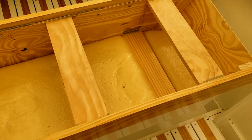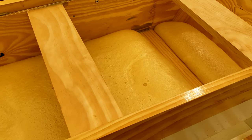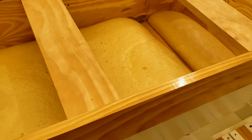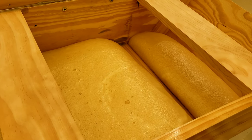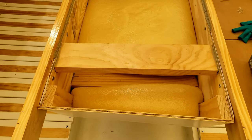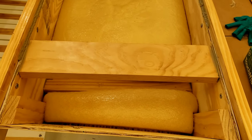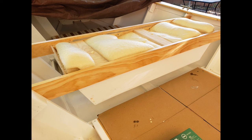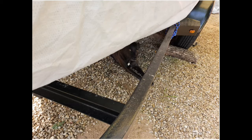Here's another sped-up view of the other seat. You have about 15 minutes until this stuff is fully cured — it doesn't take a lot of time. After 15 or 20 minutes, you can actually touch it and it feels hard. I did this in two pours per seat. According to the specifications, I should now have 600 extra pounds of flotation in my boat. This stuff is extremely sticky and you'll go through a lot of containers. My assistant? She wanted no part of that.